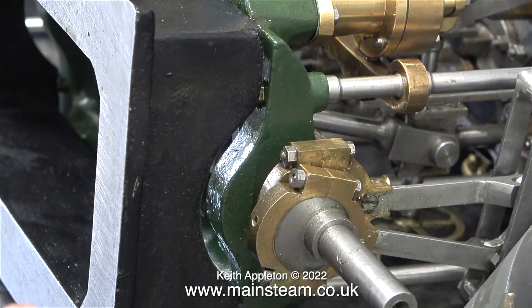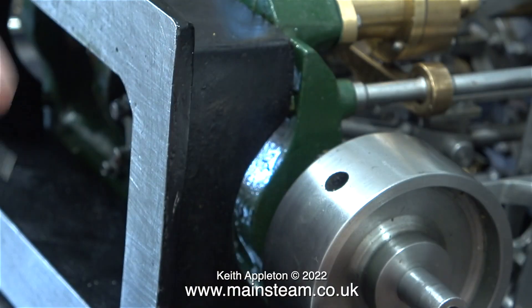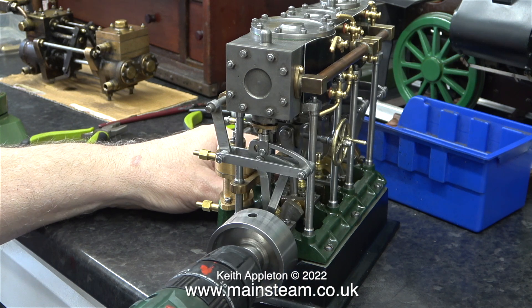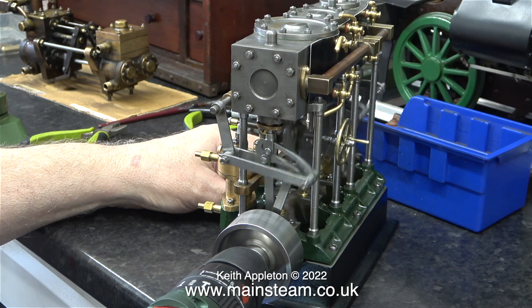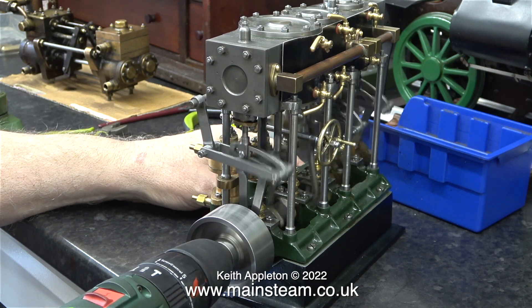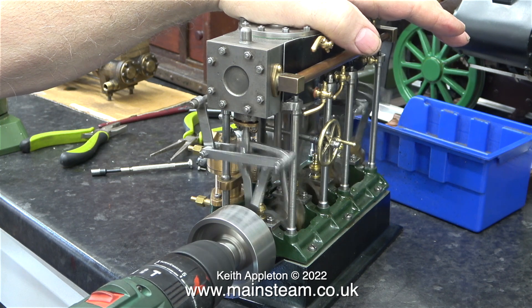If you are a beginner to the hobby I definitely do not recommend building a Stuart triple expansion engine as your first project. I am not a machinist and I freely admit this, and because of that I wouldn't want to make one of these from scratch - there's an awful lot of machining to do. Now it's time to move the engine into the upright position, connect my electric drill to the crankshaft and run the engine at a higher speed. If you look closely you will see that the cylinder block is moving around on the upright standards - they definitely need bolting down before the engine is finally finished. I'm still quite a long way off that yet, and don't forget the front part of the crosshead is not yet assembled because that is also the bracket that drives the air pump. By running the engine like this it is actually freeing up - it felt much better after running it for about 20 minutes with the electric drill, first slowly then a bit quicker. Running at this speed I needed to stop the engine frequently for more oil.